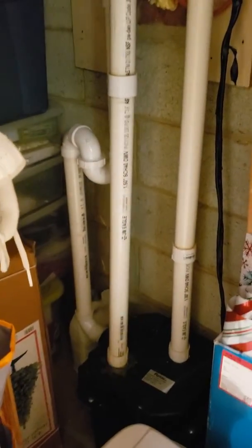We need to put a check valve on this thing as well. So 10 feet of jackhammering, three-inch pipe, a whole bunch of rework in the back for both the laundry tray and the washing machine — run that in three inch, reconfigure the Y there, and bring it all the way to here.